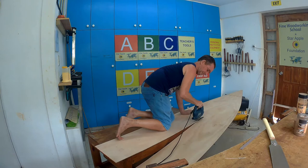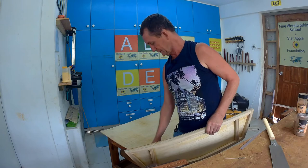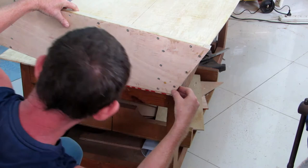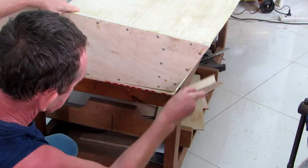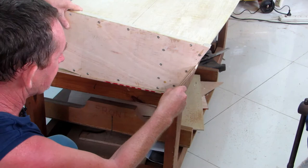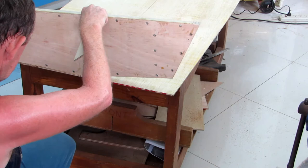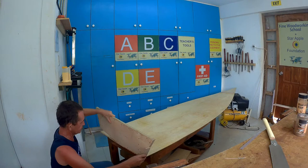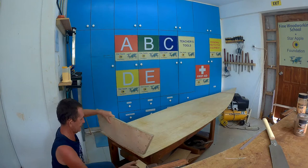What I was saying earlier is that because the other plywood is going down here, this one might be a little bit big. So I'll just put it on one side like this. I'll just get a sample piece of wood and put it in here and put the line here in the middle. That's fine. And on this side, maybe it's a slight bit different. The boat has to be very balanced. That is perfect — it's running flush there, and then this will be bull-nosed with the plane before we start glassing the outside of the boat. So the transom is fine.